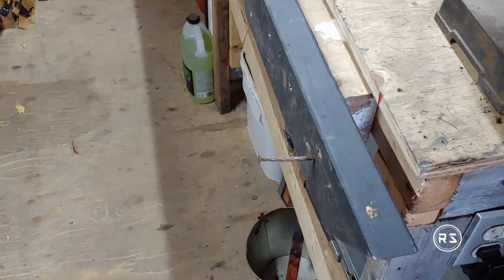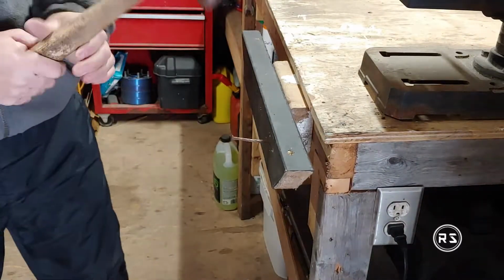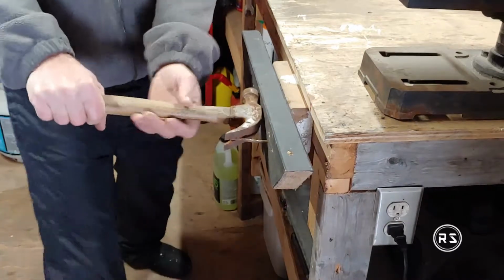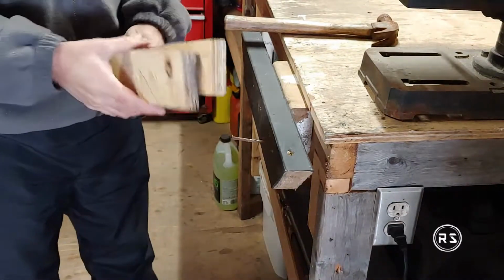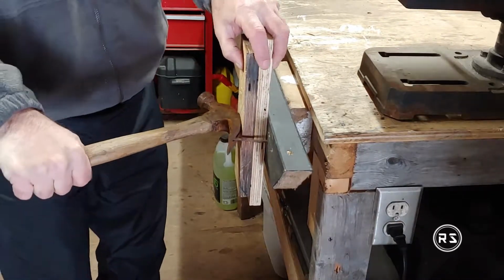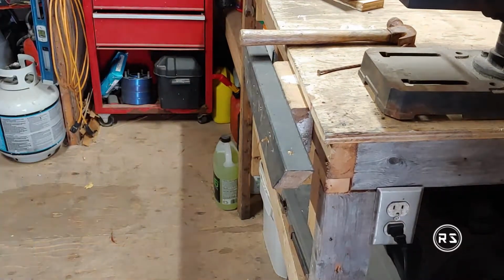Oh, those good old twisted nails. Everybody who's doing renovation, construction, or simply living in an old house and has to renovate some area sometime, I've seen those nails before. It is practically impossible to take them out, especially with the type of hammer which a lot of people who only do do-it-yourself stuff are using. But it is possible to remove that nail even with that hammer. You just need to place a couple of pieces of wood to raise your hammer more equal to the head of the nail, and you will be able to remove it very easily, just like that. If you don't use this method, you will probably end up breaking the handle of your hammer or hurting yourself with the struggle.